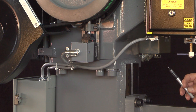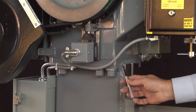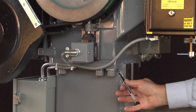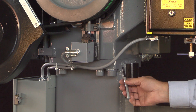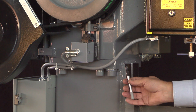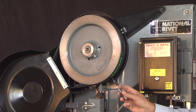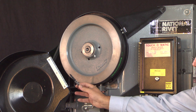When we have achieved perfect or near-perfect alignment, we'll want to re-tighten the six main bolts that hold the head. We'll do that by carefully snugging them first so we do not disturb our alignment, and then torquing them to the proper spec — an ANSI spec can be followed. After properly torquing these bolts, we need to re-tighten the socket set screw and check the belt tension.